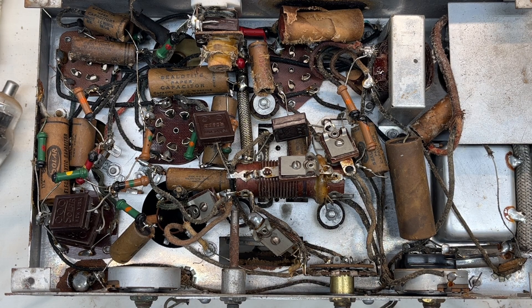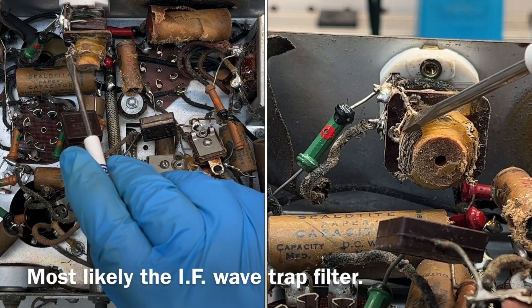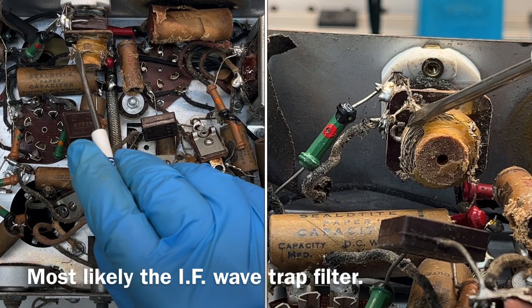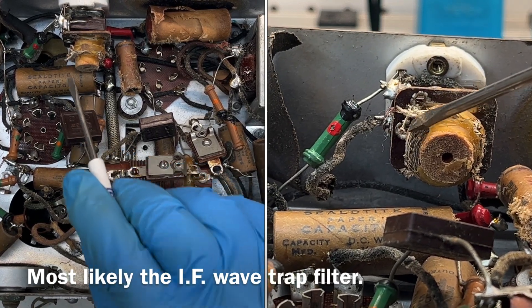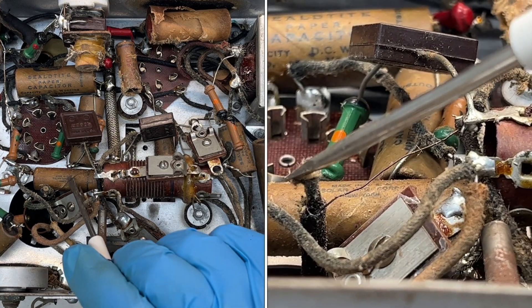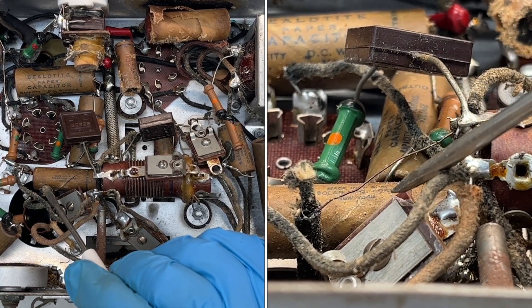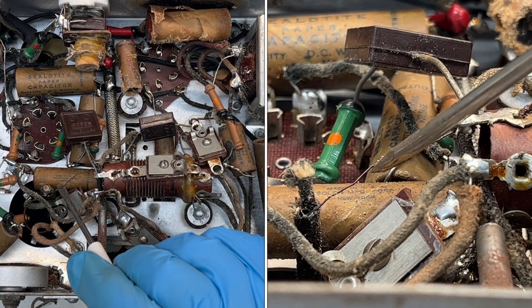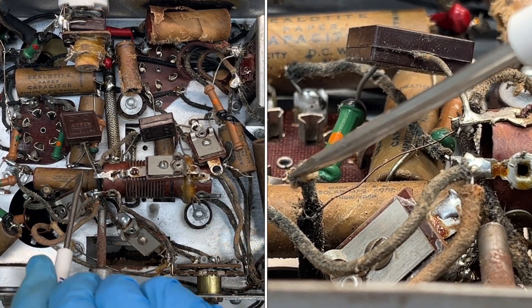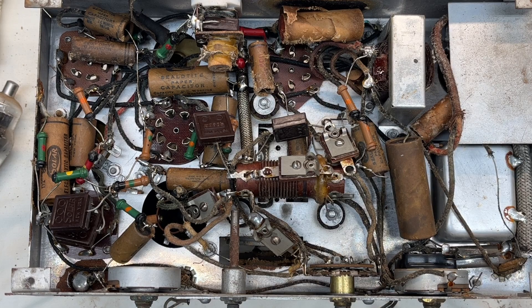Probably most concerning: you can see where the mice chewed away at some of the paper on the capacitors as well as the wire going to the switch from the battery. We'll have to figure out what this coil does, but you can see they've eaten through the Litz wire on this coil. And there's a conductor here with a center conductor and an outer conductor attaching, but this one goes nowhere — I don't know if that's by design or not.